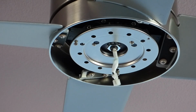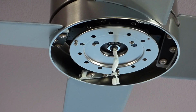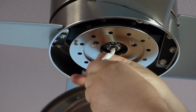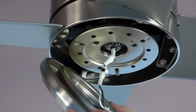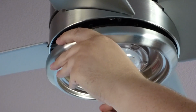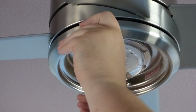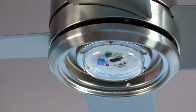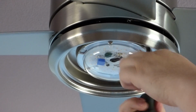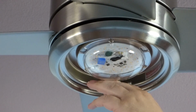then the connection. So, you have this plug here, and you have this plug here. Now don't just go plug it in anything, even though it doesn't matter probably, but you got a black wire on one side, and a black wire on the other side, so make sure they're matched up, as well as the white wires on the other sides. There. Done nicely. And then twist it around till you find out which way they go. And there. Put it back in, give it a twist. Put your screws you took out up through the bottom here and into that plate, which you can kind of see if you look at it from the side of here. Alright, so we'll tighten that up. Nice and snug, as well as the other 2.